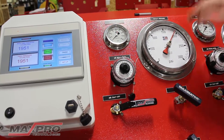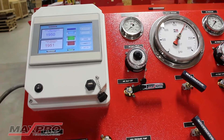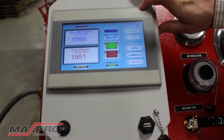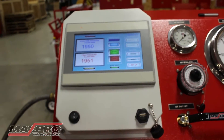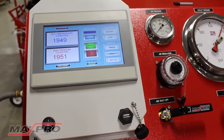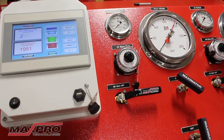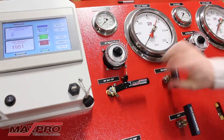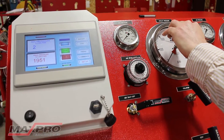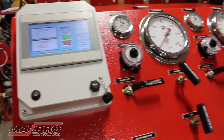At this point we're holding pressure here and on the logger. We've isolated the pump out of the equation for however long you would need to hold the test. You can look at it digitally or with the chart and switch back and forth. When we're satisfied it's met the pressure requirements, we can press stop on the logger and go ahead and vent the test piece. Shut the main water off so we don't free flow through the pump and open the isolation. Go ahead and set the max pressure indicator back to zero on the gauge. At this point we know there's no pressure in either circuit, so it would be safe to open the enclosure and remove the test part.